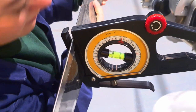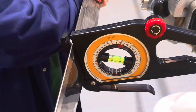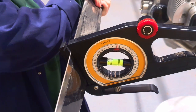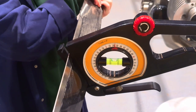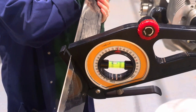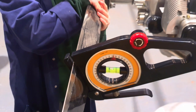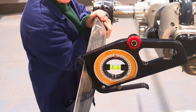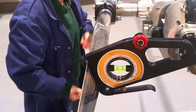We can see here that we are not at the right pitch. Lainey is going to go in from the root and adjust the blade ever so slightly until she gets the bubble in the right place. First she's gone in the wrong direction to show us how to go the wrong way, and then she pitches it the other way so you can see the bubble moving in. We all have to take time to learn. That's it — that's perfect.